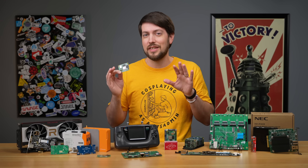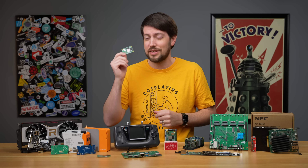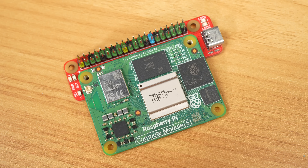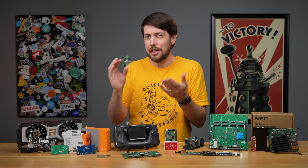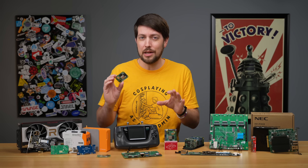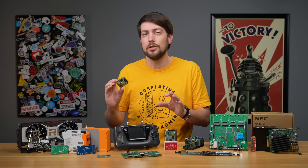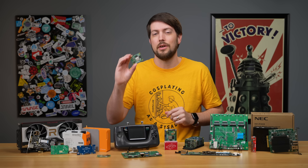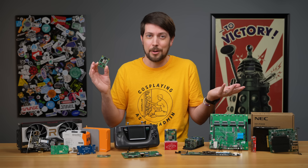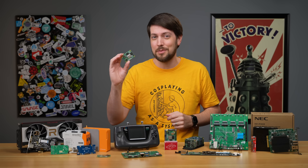Most CM4 cases and accessories still work with it; there's just a lot more bandwidth. The big advantage to a Compute Module versus a normal Pi 5 is modularity. Let's say you don't care about USB, but you want to build a device with two 2.5 gig network ports. You could put two USB to 2.5 gig ethernet chips on a board, drop the Compute Module 5 in there, and boom — tiny 2.5 gig router — and you still get PCI Express to play around with.